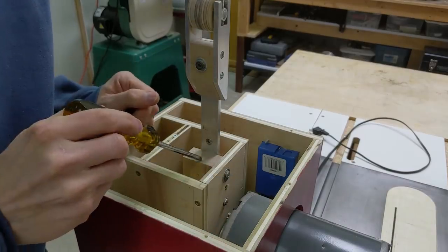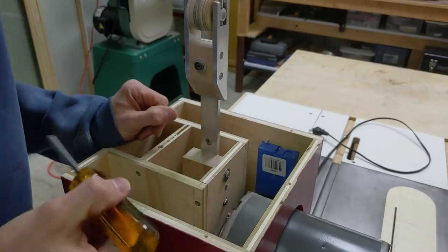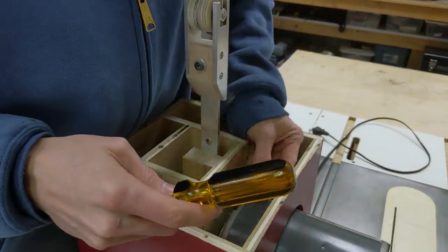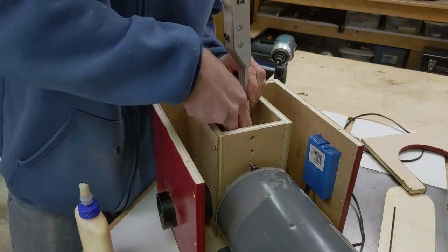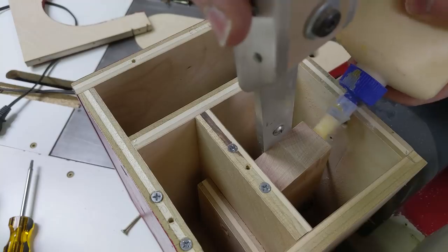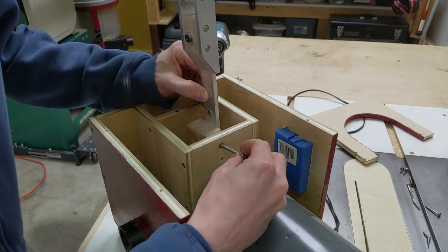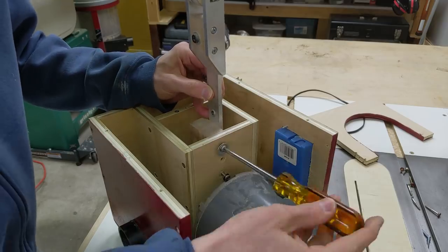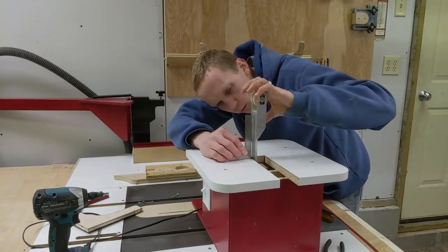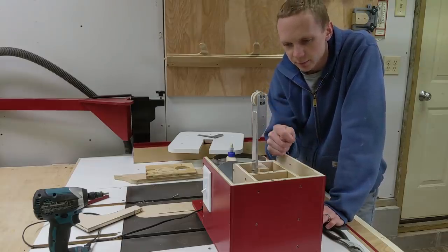Here you can see the two screws that hold this block to the main frame. The top one isn't very tight because it's an oversized hole to allow for some adjustment, but I'm just going to remove that and glue it in place. I can't quite get the bottom bolt out because it's running into the motor, but I've got this block off far enough that I should be able to get some glue to squeeze down in there. With some glue on there I'll reassemble it and get it as square as possible. I'm pretty happy with how square that is — with that glue on the joint, I know that post is never going to move again.